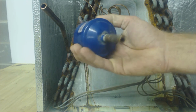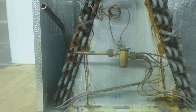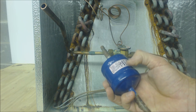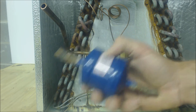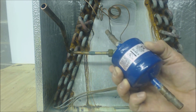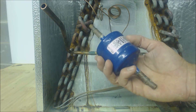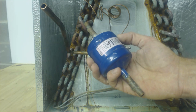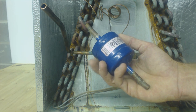Here's the face of the evaporator coil — you're going to have a liquid line coming out right here and you put your filter dryer installed right here, whether you're coming up or coming down. Always make sure the arrow is facing towards the TXV and towards the evaporator coil. If it's going to be in the way right in front of the evaporator coil, go ahead and run three feet of line set and then put it in there. Put it on the liquid line between the outdoor unit and the indoor unit, in a location where weather won't get to it.